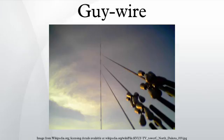The insulators must only withstand the maximum transmission voltage. On some mast antennas, guys of non-conductive polymer line are used. Although these guys alleviate the electrical problems associated with conductive cable, they are rarely used as they are not as durable and long-lasting as metal guys.